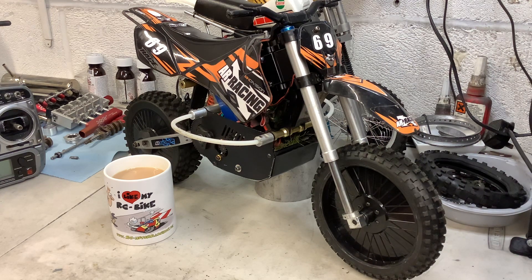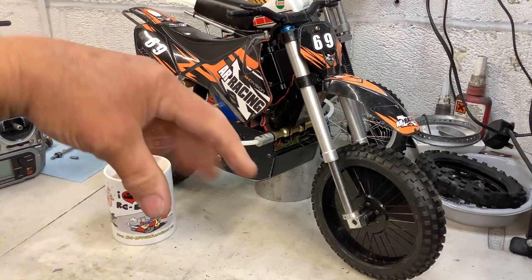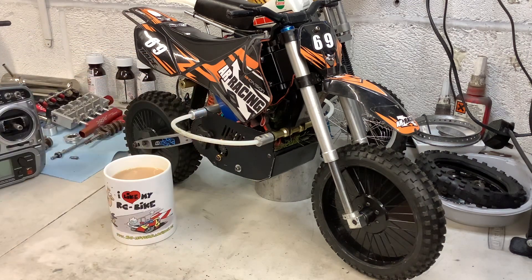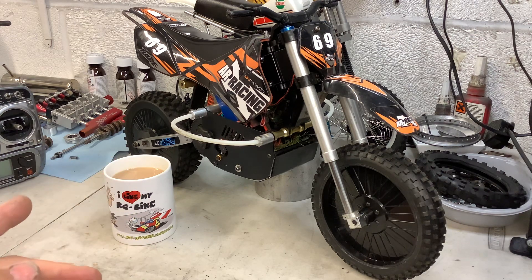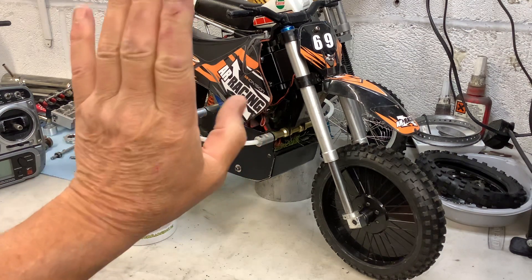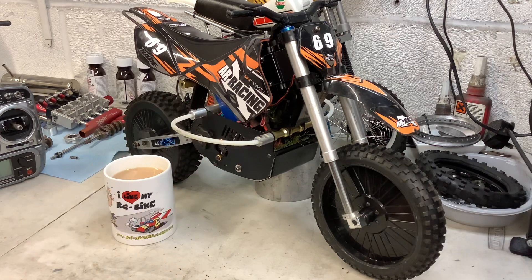You've got them in the right position on the helicopter, they kind of sit flat and they go around that way to work the tail. So I was thinking I had some really old, when I first started flying, cheap GWS gyros, which kind of worked in a different way. They used to stand up that way and move around like that. So I wondered if I could put them in the bike, in between the throttle and the receiver, so that when the bike actually reared up, it would shut the throttle, and when it came down again, it would put the throttle back on.